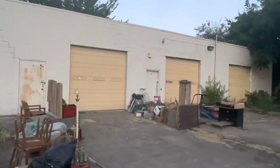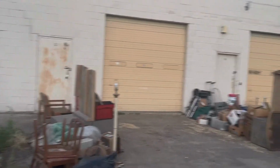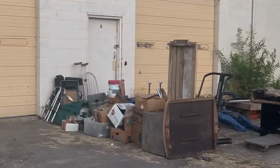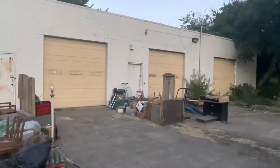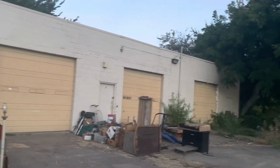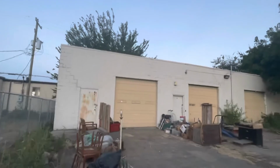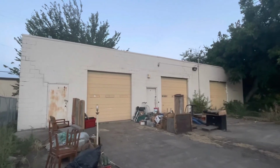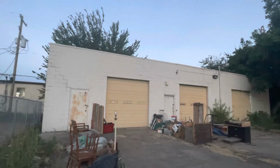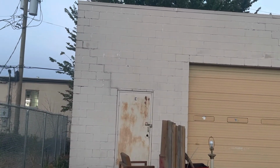Your other additional charges would be primer on this door and a little on this door where needed. There is definitely a need. And then second to that could be primer on these lintels. If you look at them, they're in really rough shape, but they also need to be scraped. If you're scraping upside down, stuff getting in your hair and in your face, the cleanup, all of that's involved. So there's that, and then there's the crack repairs. Those would all be the additional charges.